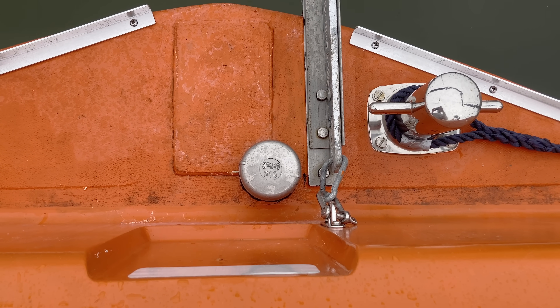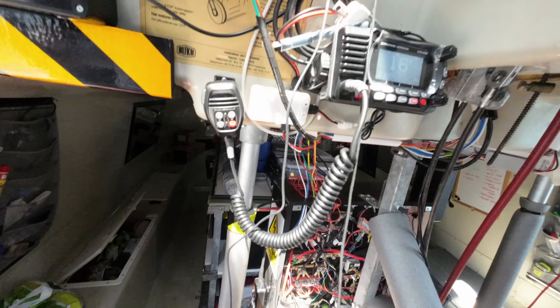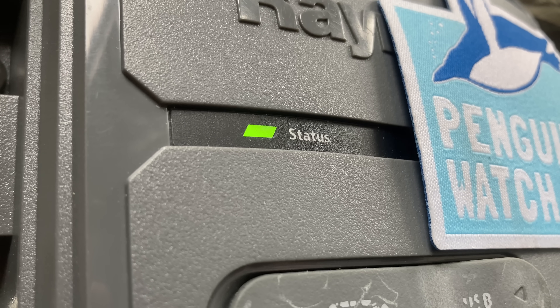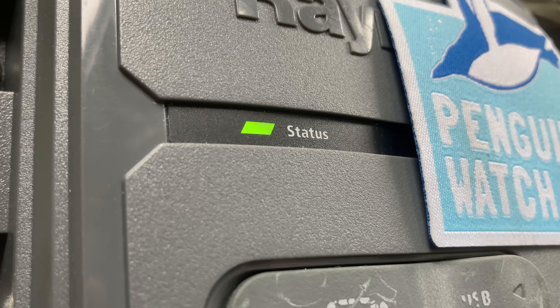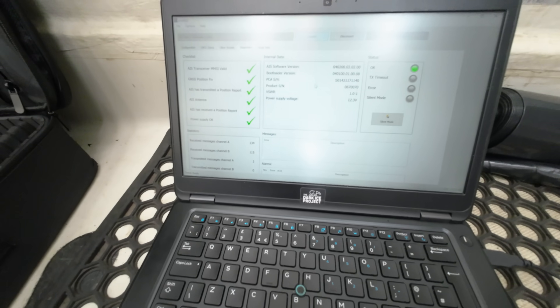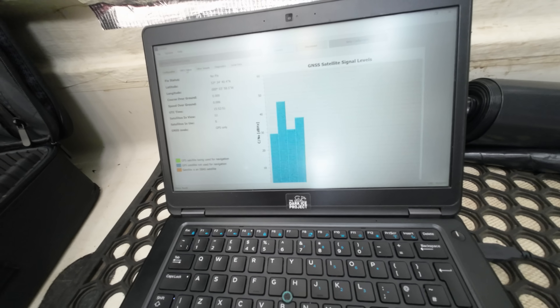Back to my AIS diagnostic amateur dramatics, and the PC software was hardly helping. I was really lucky I had the software here so I could try and diagnose, but the problem is it doesn't really tell you what you've done wrong — it just tells you that there's an error or you're in silent mode. And when you try and turn silent mode off, it just went pending, and then back off again. But behold — look at this. The infernal blue silent mode light is now green, and the unit is reading satellites. I'm picking up other boats, and all the transmit ticks are green. The unit is working.